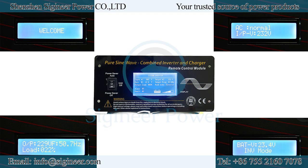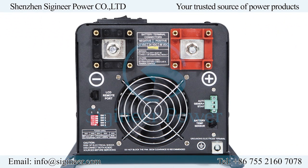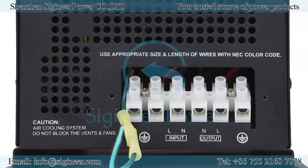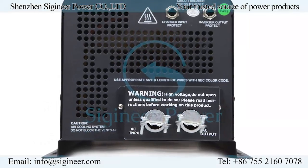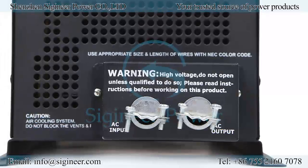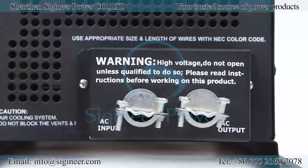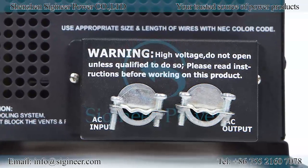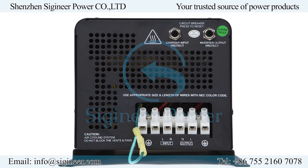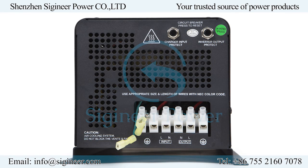There are two DC terminals, one red and one black. With the AC direct connect terminal block, you can hardwire your AC input and output. This inverter charger features an AC wiring compartment with two strain relief connectors to access the AC input and output terminal block. This inverter can be built with an optional automatic neutral-to-ground connection in the factory, but this connection can be defeated by separating the insulated connectors on the green wire near the AC terminal block, so it will not bond neutral in any mode of operation.